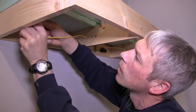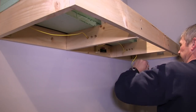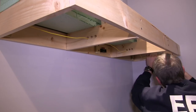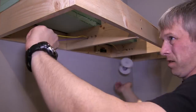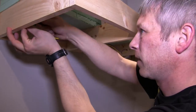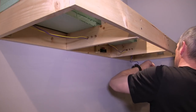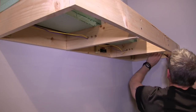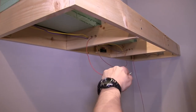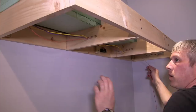After drilling three holes in the bench work for the wiring, I get started running my bus lines. I'm going to run three sets of bus lines: yellow and purple for all the lighting, red and black for all of the tortoises and the switch panel, and blue and white for my DCC bus. I like to color-code all my wiring — it helps with troubleshooting when you're underneath the bench work so you can tell what is what in that big wire bundle.